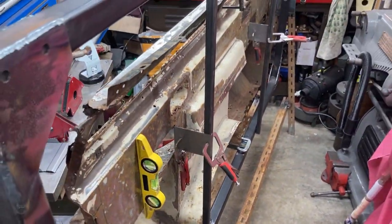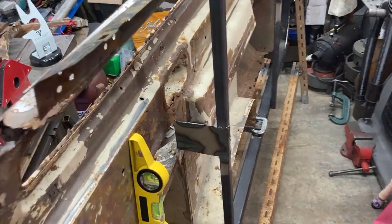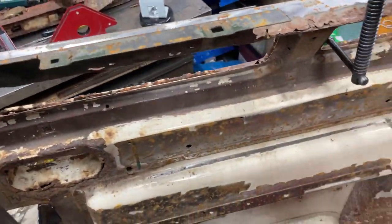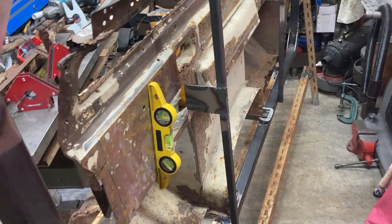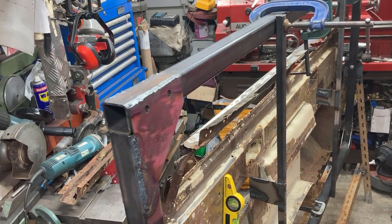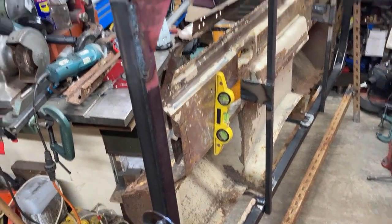Well, it's safe to say, aside from the interruptions, that was a bloody nightmare. Must remember: never try and weld one mil to three mil. It's taken me — well, basically I've ended up doing both of them — and it took me till the last bit till I got the hang of it. But anyway, it's on now, it's pretty well there. I can't get a decent shot of it because there's no room to back up. It's clamped at the bottom. I need to decide whether I'm going to just tack weld the verticals in position — which I think wouldn't be a bad idea — or drill them through and put a bolt through them, because I don't want to leave the G-clamps on there as I'll probably need them anyway.